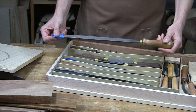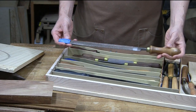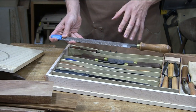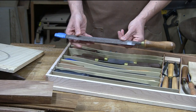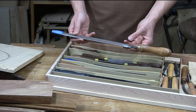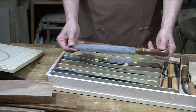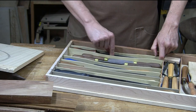This is a Number 6 grain — this is a Liogier rasp. Number 6 grain is very, very aggressive. It will cut very, very fast. But these go all the way down to a Number 1 grain. The grain is the coarseness or fineness of the rasp — think of it like grit in sandpaper: 80 grit, 120 grit. This is a 6 grain, very, very rough. This cabinet maker's rasp is a 9 grain — this is kind of your general all-around jack plane of rasps.